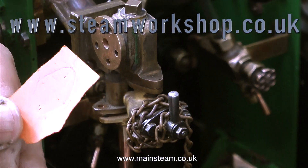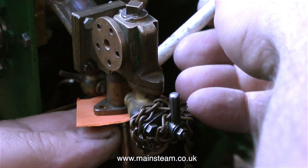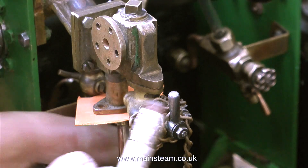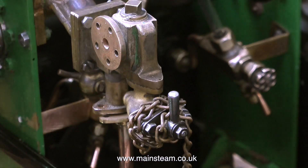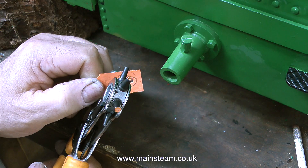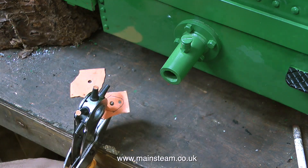Well, they both do, so I'm making two gaskets — one for the water pump inlet and one for the water pump outlet. The easiest way to make these gaskets is just to sandwich the gasket material between the two flanges and draw around them, not forgetting to mark the positions for the holes. I can't mark the position for the center hole, but I've got a pretty good idea where that is, so I punched that first in the center of the gasket.